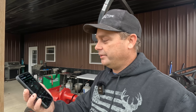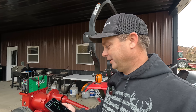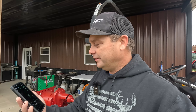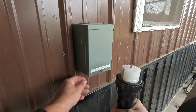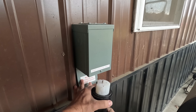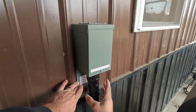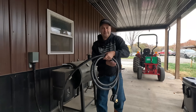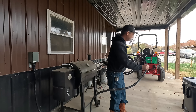The solar power system is designed to work with a standby generator that starts and stops automatically. We don't have a fancy standby generator — we have a manual one. The way it works is when the batteries get down to 20%, it will request a generator, and I just need to make sure to start this generator up at that point. I've got a heavy-duty 50-amp cord, about 25-30 feet long, that plugs in and twists to lock — plenty long enough to reach.